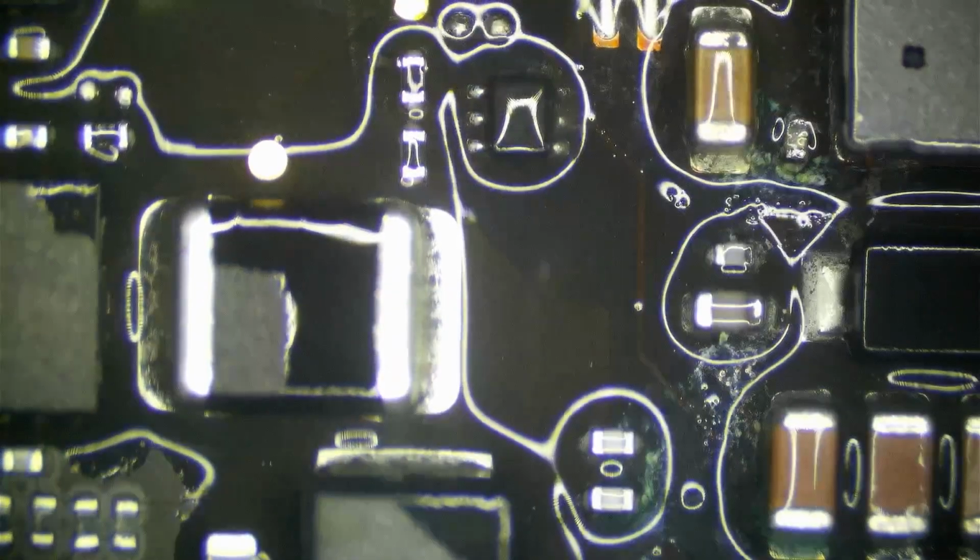This has actually been to Apple, and they sent it to their depot first, and they apparently said it's not fixable, but we're going to prove them wrong tonight. Yeah, so see, this corrosion is nasty, but it is superficial. There's certain capacitors that can stay and certain ones that can go. This is our keyboard backlight inductor, 'cause it's the same as the 2251.